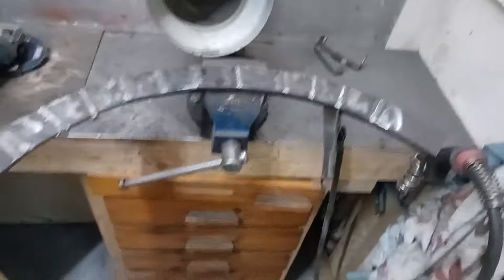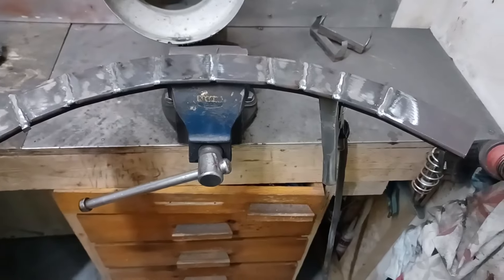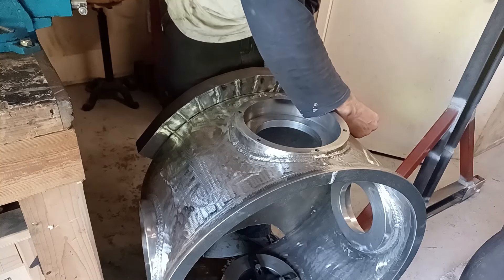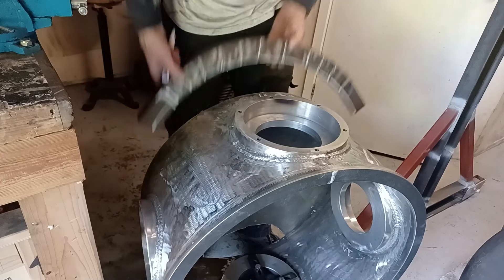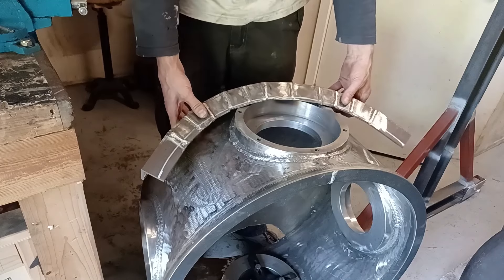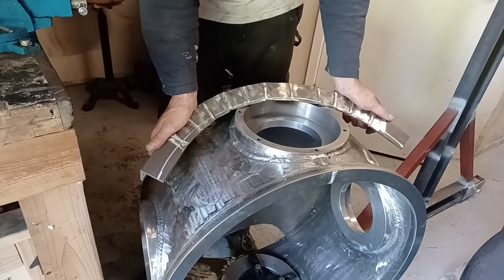Admittedly that's not the neatest thing in the world, but it'll have to do. It's warped a bit with welding - I really should have realised. I'm just going to draw around the arc now and grind the rest out. There's quite a lot, actually. What I'm going to do is grind it round. There's a little bit to come in - might plasma cut that off. I'll have to carry on with that next week. The whole point of this is I just can't risk that bit distorting. You can see how stuff distorts when you're not paying attention. I don't want to mess this up at the last hurdle.